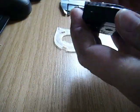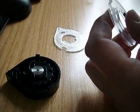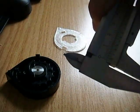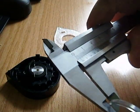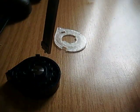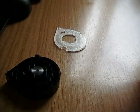I'll show you why the long ones don't fit. It's because the round viewing thing on these ones is just under 2mm. So you've got 10mm inside there, 3mm here minus the 2mm, so you can only really get 11mm slugs in here at the most. So if there's anything along with that, it'll jam.